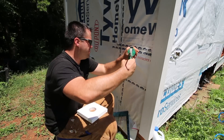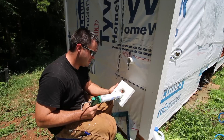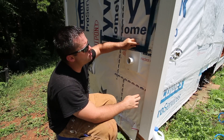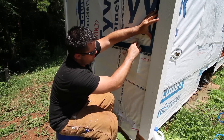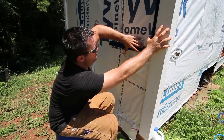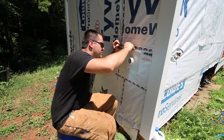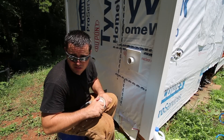I'm going to put a healthy dose of caulk right back here and a little bit here as well. I'm alright with some squeeze out. There's no real way to figure out plumb here, but if I take my framing square and put it against that and bring it down to it, I can just push it until it's good — that's running perfect. I'll make sure I'm not hitting anything when I nail. Then I put silicone in the top, take my drip cap, make sure it squeezes out up top, smooth the silicone, and pop it in there. It looks good.